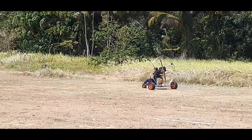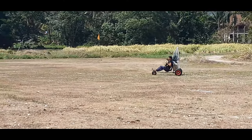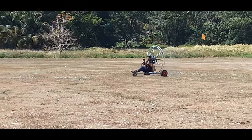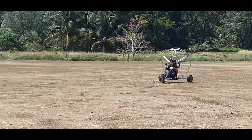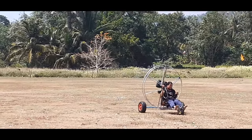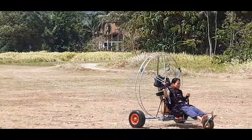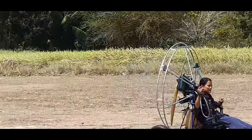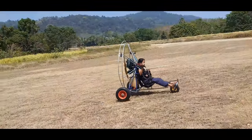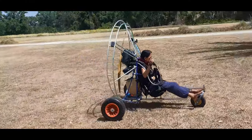That's a 120cc motor. I think Nimbus was the brand name, out of Austria. It's a foot launch unit I bought from a guy over here that had a crash on his first flight. I built the double ring steel cage out of EMT metal conduit tubing. Kept it really light. It brazed real well. It's real strong. I got it with quick pins and Velcro to stay in place. You need the double row tubing for trikes, because the netting pinches in when you go to inflate. And then the wheels and so forth, we'll hope it's strong enough. It slides so it'll come apart.